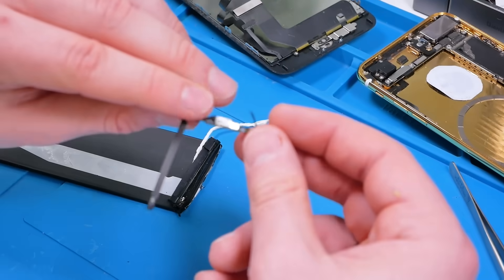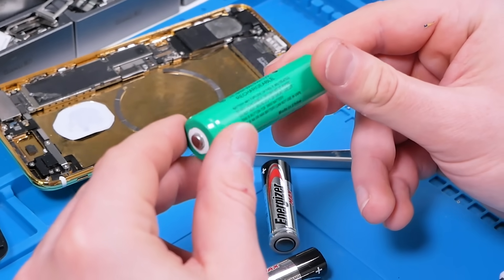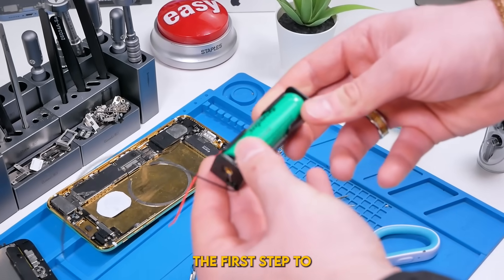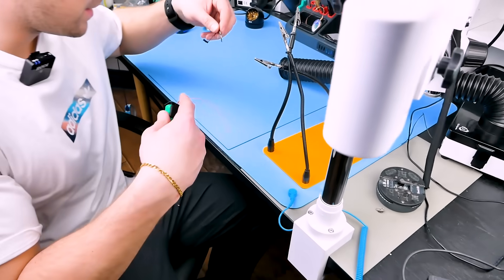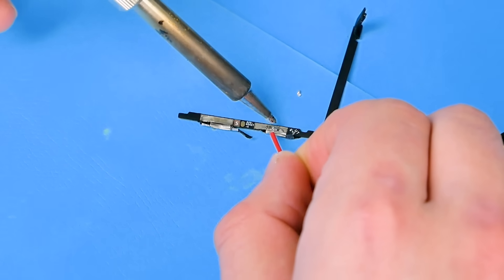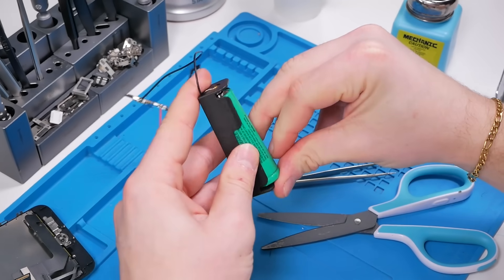We have the BMS removed. I have been wanting to do this for so long, and I've tried a ton of different batteries for this project. The best battery I found was the 18650 battery. If you don't know what this battery is, well, you probably use it almost every day without realizing — this battery is in a ton of electronics around the house. This is the battery holder we're going to be using. It has a wire for the negative and positive terminal, and it's made for the 18650 battery. The first step is to solder this battery holder onto the BMS board, and then plug it into the phone and see what happens. We'll bring this over to our soldering station. We have to solder the red cable to the positive terminal and the black negative cable to the negative terminal.